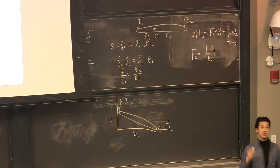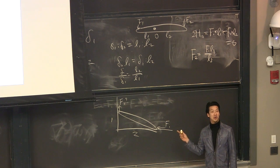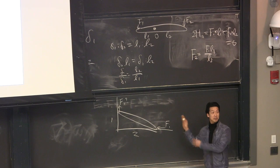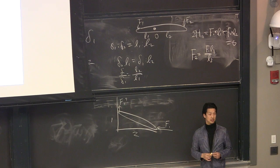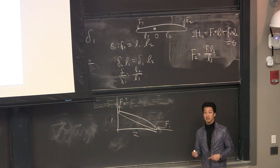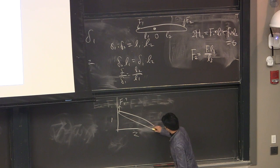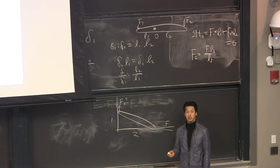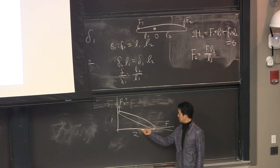So what's the procedure? Identify rigid bodies, right? Here it's very simple, one rigid body. Now, where is the center of rotation of this guy? I wish I had some linkage anchored to the ground so I could start from it, but there's no rigid body in this case anchored to the ground. So let's find the known velocity directions. Then you can calculate the center of rotation, right? Which point do you know the velocity of? The point touching the ground: which direction is its velocity? To the left, right? Because I said it's sliding against it.